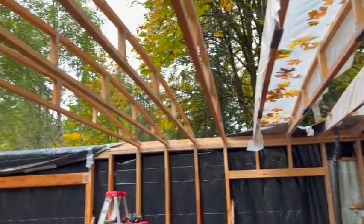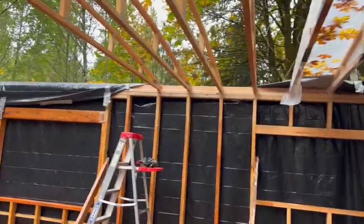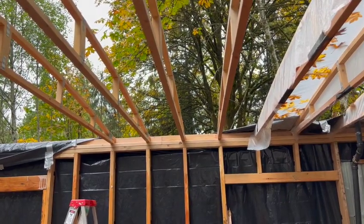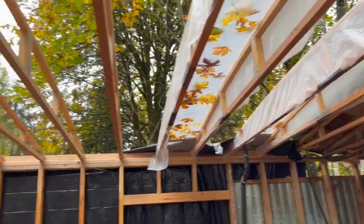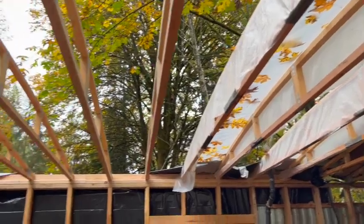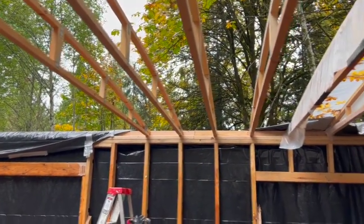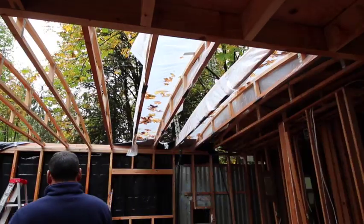So I'll put them over. I think technically you can go over every other joist, but I'll just put one on each. What the heck? So we'll cover all those and then try to level these out and put some plywood up there and then not have to worry about the rain as much. Yeah, still gotta worry about it, but anyway.